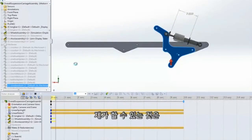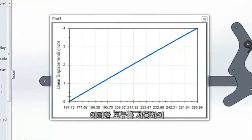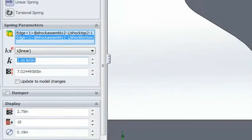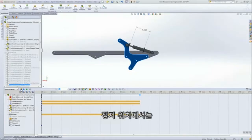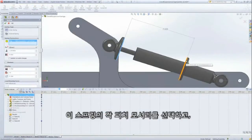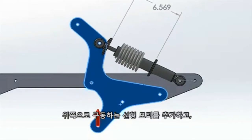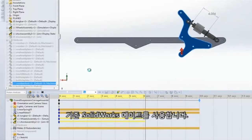Now onto the analysis. I can create really powerful SOLIDWORKS motion studies, including actual engineering calculations. We can use these tools to determine, for any given load we put on our vehicle, how much this suspension will sag given the known spring values from the shock manufacturer. To set it up, you place a reference dimension so we can watch the spring length change in real time, and then at rest position we create a motion analysis on the overall assembly. We have to add a spring, pick the edges of each perch on that spring, enter the given spring rate, the free length, and if you like, the display options in 3D. Next, we add a linear motor that drives the lower bogey wheel pivot point upward, and finally we click calculate to watch it go. It already knows to use the existing SOLIDWORKS mates for the range of motion.